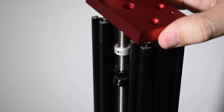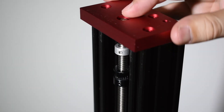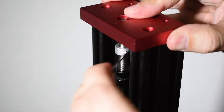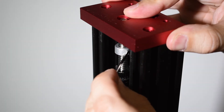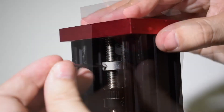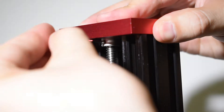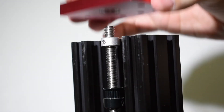Place the end plates on top — we just want to use them as reference for the lock collar position. Now adjust the position of the lock collar so that it's touching the bearing and tighten the set screw. At the end, take the end plates out.